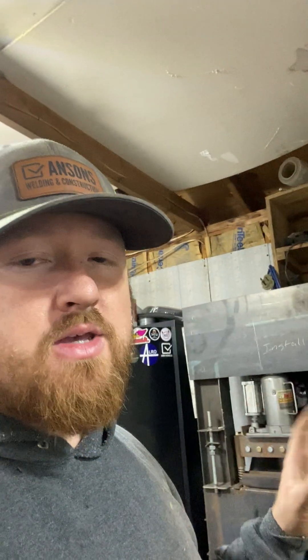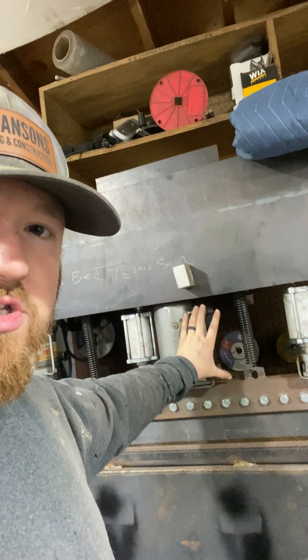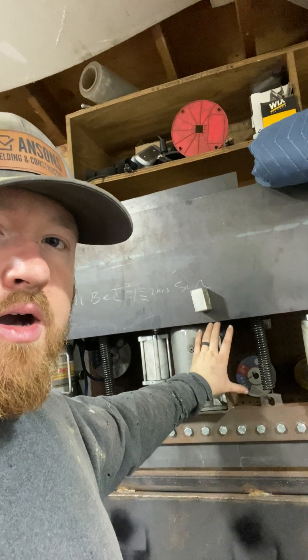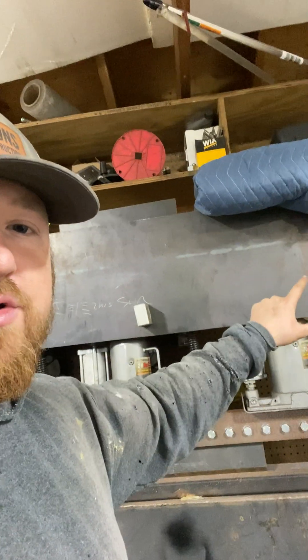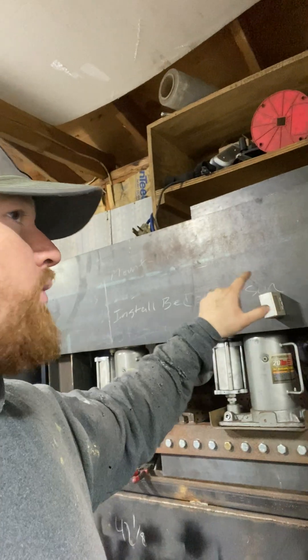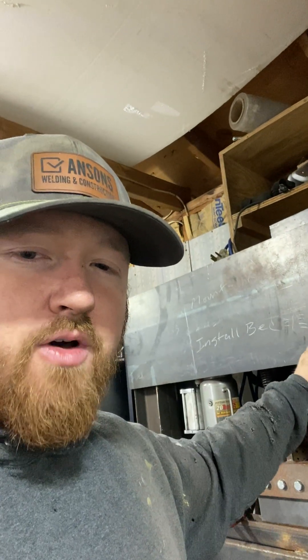What I wish I would have done was skip the air-over-hydraulic rams and use hydraulic fluid rams instead. If I were to build it again, I would have taken inch-and-a-half plate and welded it to the top of this plate, probably six inches tall, just to take some of the flex out of the bottom plate. Then I would have just plasma-cut and welded connectors on and done two hydraulic fluid rams - one on either side, maybe about a third of the way in on each side.